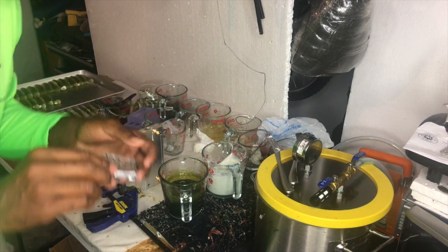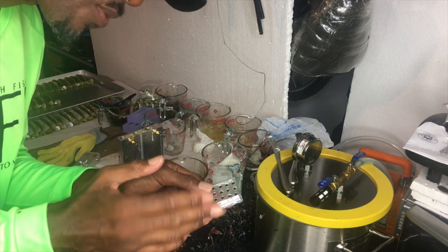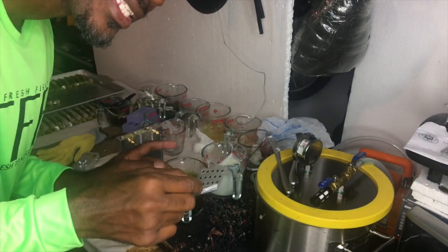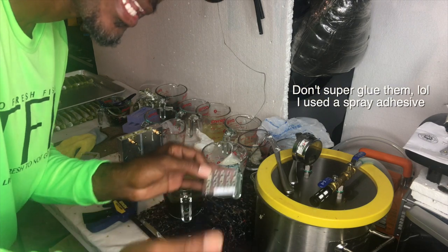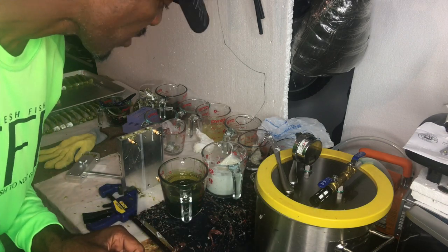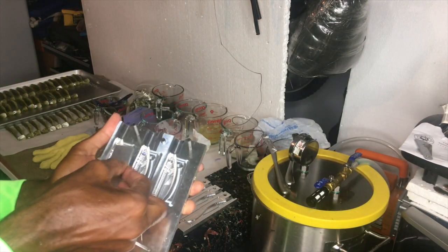While that's setting up, let me show you — I'm using the hard eyes on this mold. Normally you'd use the soft eyes because with the heated plastic it allows the eyes to really bond to the plastic during the shoot. But because I chose to use hard eyes, what I did was take three eyes on each side and basically glue them into the mold. That way, when I shoot the plastic, it creates an indentation — basically a socket area — for the eyes. After I'm done, I'm able to put the hard eyes in before the clear dip. You can see the eye sockets right here, one here, one here, and one here. Then I just put my hook slide in.